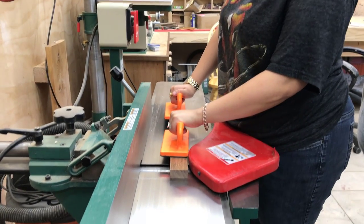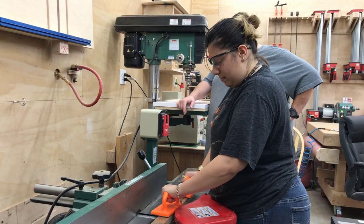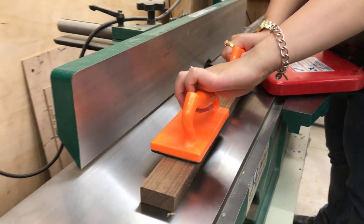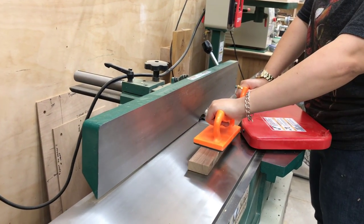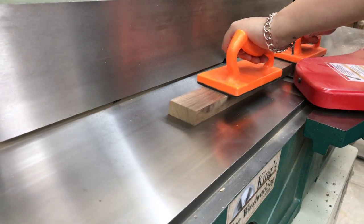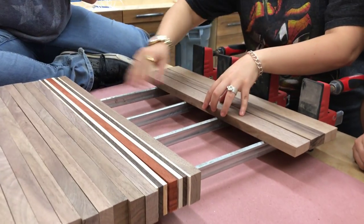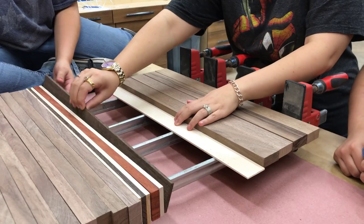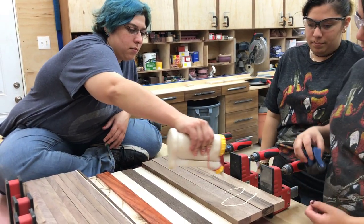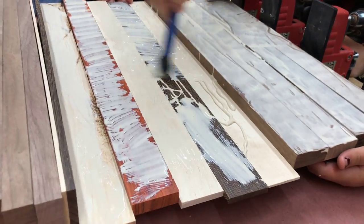Now we've got to head back over to the jointer and get some of that polyurethane finish off the used pieces that came from the cabinet door. And since it's Covita's project, we're going to make her do most of the work today. Once that's done, it's time for the glue-up. This is the quickest, easiest way to glue up a cutting board — I set the boards up the way I want to see them, then lay them down flat one at a time, apply the glue, roll it out or brush it out, and then stack them right back up.